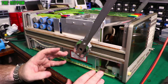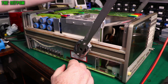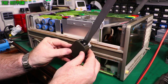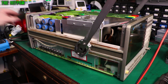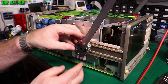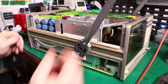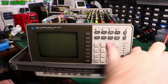Earlier on when I was trying to pull this thing apart I noticed that this tilting bale was damaged. It was all twisted, actually offset to one side - not square, bent like that. Looks like this corner had been hit and pushed it over sideways. What I've done is I've taken it off, which is actually fairly easy to do. You've got these covers which you slide off - you have to get behind them and pop the edges off. Then you've got two screws each side. Watch out because there is a spring in here - you have to hold it in place under the screws. I've squared this up and it's now actually straight. I can move it easily, fairly even gaps now. Whereas before it was all wonky.